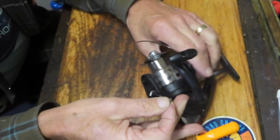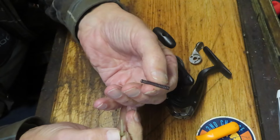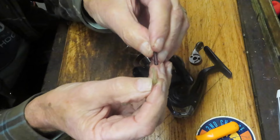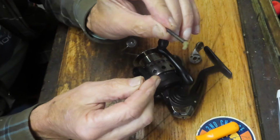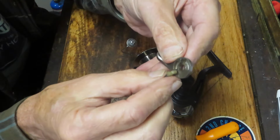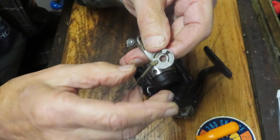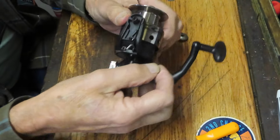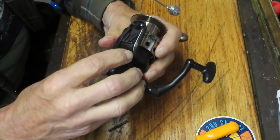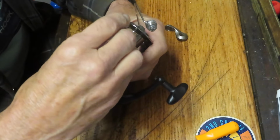Now the spring is a long spring, as I mentioned. It looks like the coil spring of a retractable pen. You have this arm here. That arm is going to nestle into that spring like this. And this part here, when we go to reinstall, is going to sit in that hole just like that. Right? Okay. That's kind of the groundwork on how the setup is. Let's do this again. Then we're going to bring this up and over. I'm going to lodge this spring in the bottom of the cavity here, just like that.